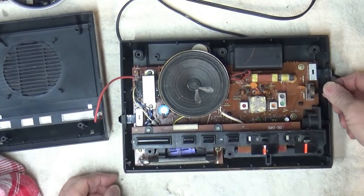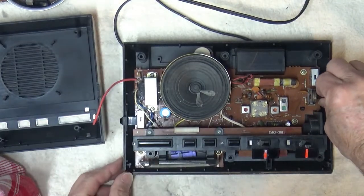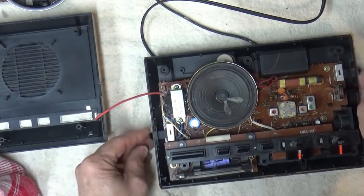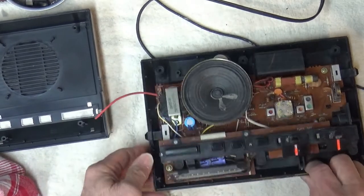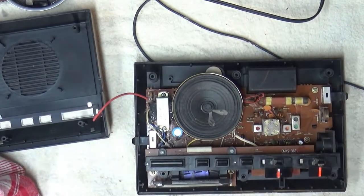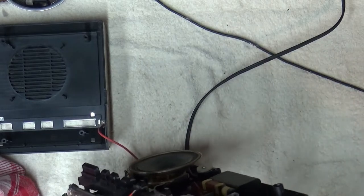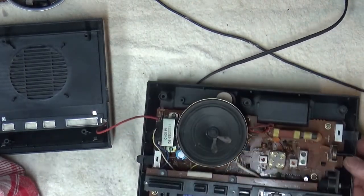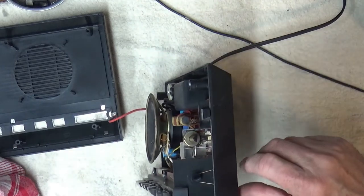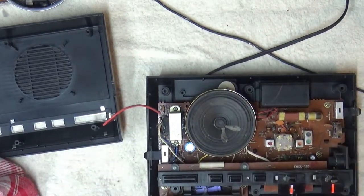We're in and got this fairly cleaned up. We do have a volume control pot here that we know is real noisy — I'll have to see if I can squirt some deoxidizer in that. I may have to get into it from the bottom. We've got two slide switches: this is the AM-FM control, and this is the brightness and dimness on the LED display on the front. I may need to pull this board out because the opening of the pot is on the bottom — I can't really get to it with the deoxidizer unless I come up from the bottom. I think I'm going to do that; that might make it easier.